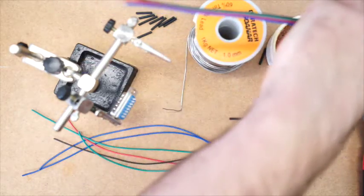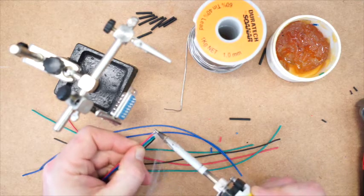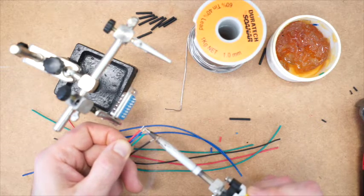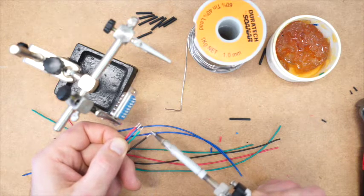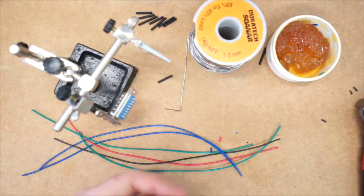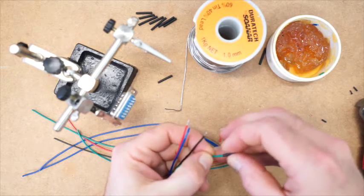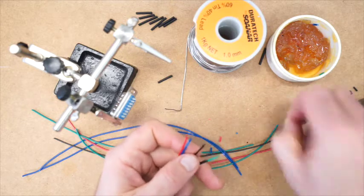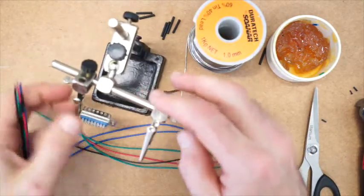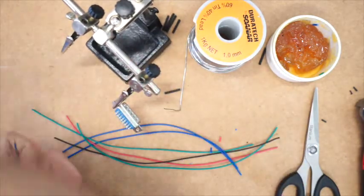And a tin. So into the flux, grab some solder. 1, 2, 3, 4. You don't need very much heat shrink, it's just got to cover the bare wires, so I might even cut those in half. That's good. Alright, and you just got to get this at an angle that suits best. I might even just use this one. Grab this.